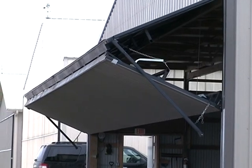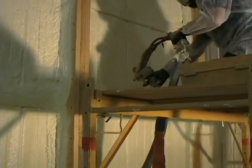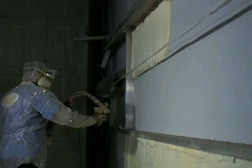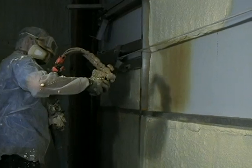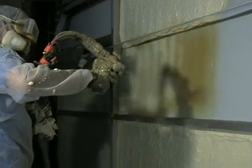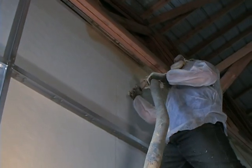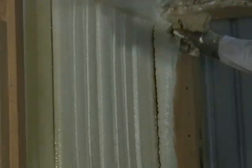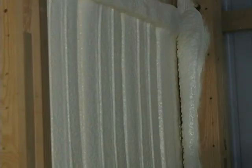Your standard airplane hangar is in a sense a pole building with a really big door. We're going to be not only insulating the building itself in terms of all the walls, but we will also be applying a layer of spray foam insulation over the entire surface of the door, adding some substantial R-value there in an otherwise very difficult to insulate area. This is going to help give us a much more tight air seal around the entire building.